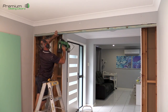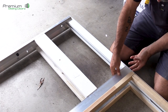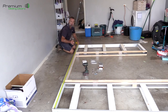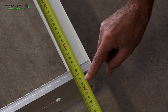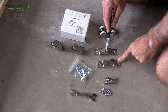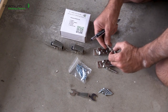I'm going to pack the bottom, check everything for level and square, and once that's in position I can build the cavity frames in place. Once that's all screwed together there are screw holes in the top and at the base that will hold it nice and rigid. I want to add 10 millimeters clearance on each side of the frame, so that's 2870 — we'll make the overall frame width 2890. In each cavity you'll get a box, so you've got the extra roller, two plates that attach to the top of the door, and two hanging bolts.